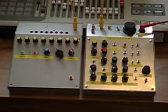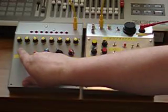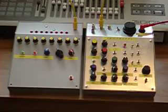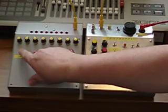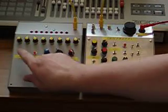There's a nice trick we can do with this which we can't do with the 4017-type design like the Baby 10 sequencer. Because it's based on a shift register, we can actually introduce more beats into the pattern. By pressing the program control again, we can get a pattern like that which you can't do in a normal sequencer. In this situation, the higher of the two illuminated voltages gets taken to the output, producing an arpeggio based on our original notes but excluding some of them. So we can get different patterns of that type running.